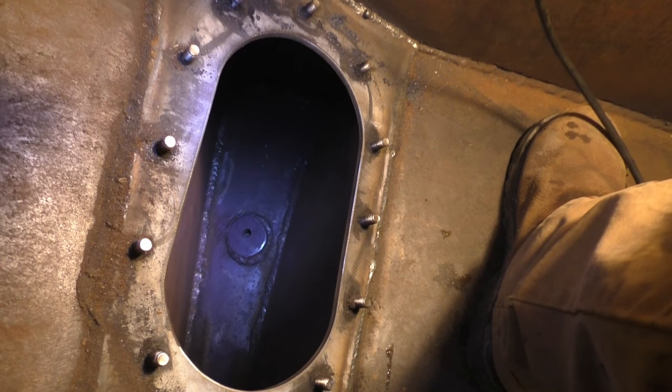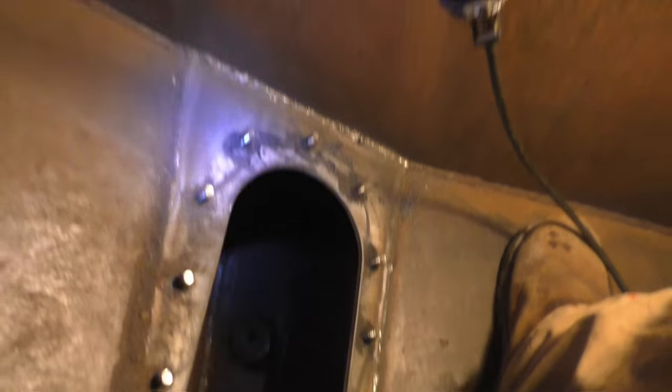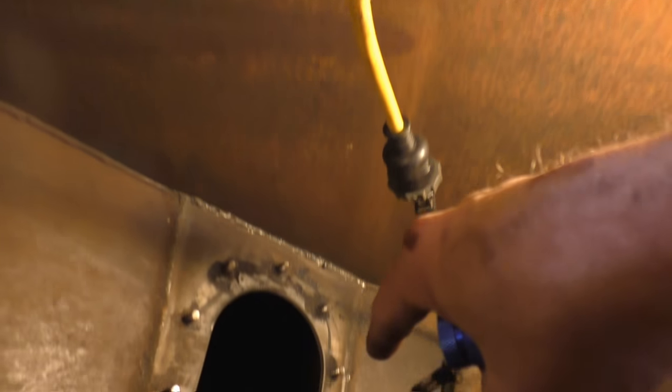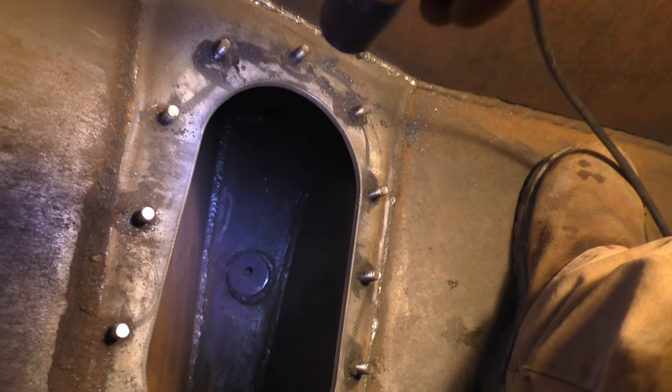You can see there's a little 3/8-inch tap down there on that plate of steel, and there's another one up front the same way. What we're doing is we're putting some antifreeze in there and drawing the antifreeze back through. The reason is there's some water down in there and we've got some freeze damage — I'll show it to you on the outside.